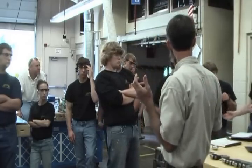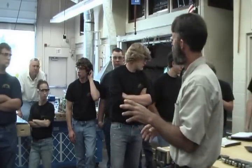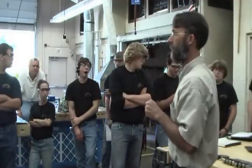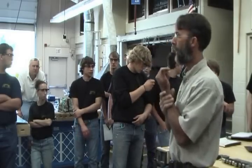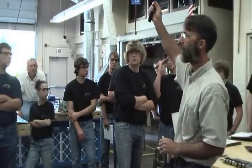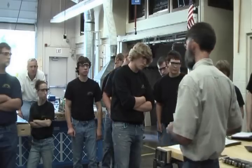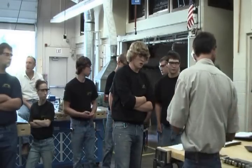Okay, we've got the hollow grinding done. We're done with the grinder altogether. If there's a crisis and you have to run in and cut something, that'll cut. But if we want to do some fine work, now we want to bring up that razor edge. Okay? Wider blades take longer. That's all that is. So if you're bringing one from home, bring a smaller, narrower one. Learn on those.